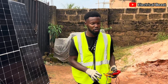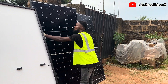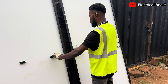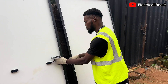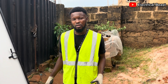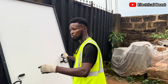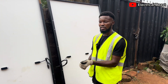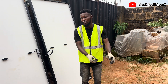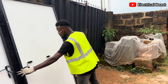For parallel connection, what you do is simply connect the positive of one panel to the positive of another panel, and then connect negative to negative. One downside of parallel connection is that it requires a lot of cables — you need jumper cables to connect the panels together across the string. With series connection you just connect side-to-side and only worry about the last cable to your controller or inverter, but parallel connection requires bonding cables throughout the entire string.